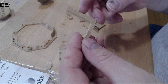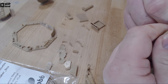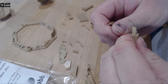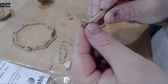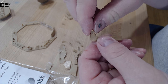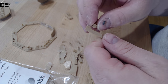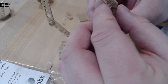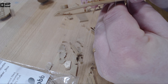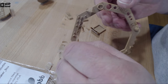I had a strength test and this one was printing on the bed flat. If I break it, it's not very difficult to break, so it's not a very strong material, but it bends maybe a little bit more than PLA so it's more flexible. The layer adhesion test with the upright print is not very good. From what I could see, the layer adhesion is poor. The bridge print had stringing issues also — it was quite stringy. And in the overhang test there were some stringing issues as well. That was the main concern I had about this filament — it was quite stringy.